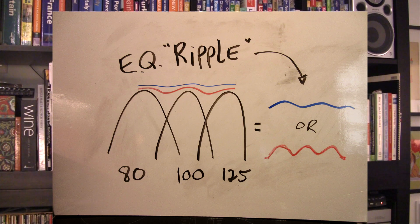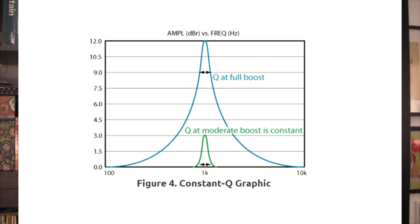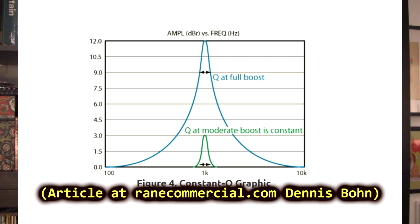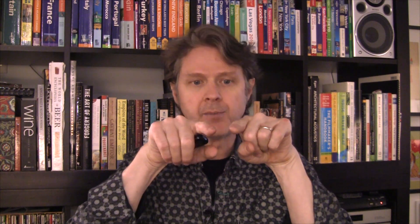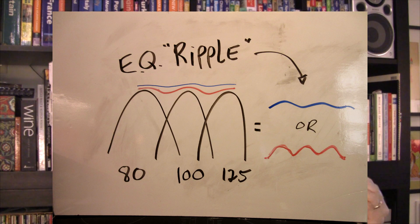Even on decent EQs like Ashley's — if you go too far away from the zero line, you're going to get more ripple response depending on the EQ. There's a popular design right now: Constant Q. Ashley has this in some of their units. With this Constant Q design Ashley EQs have implemented, I read specs on equalizers and they state there's low ripple on the output. When you take one slider and turn it up and take another slider and turn it up, you're going to get some interaction between them — a bit of ripple because of the way their combined response is on the output. Low ripple on the output is one of the sales points of Ashley's EQs. Some cheaper EQs may have more ripple on the output.